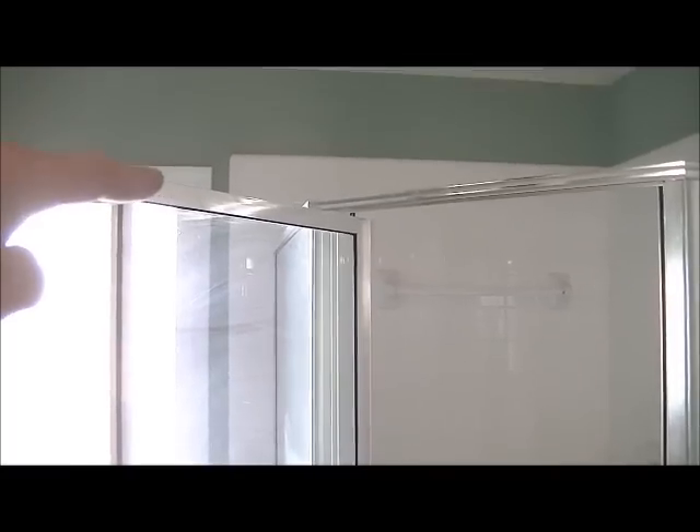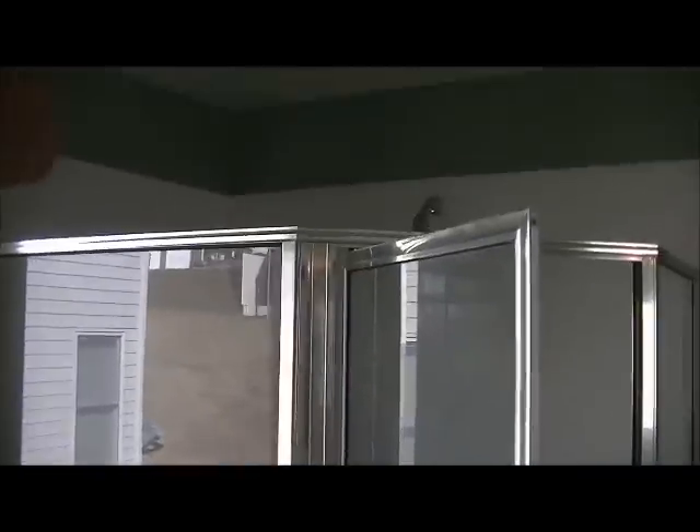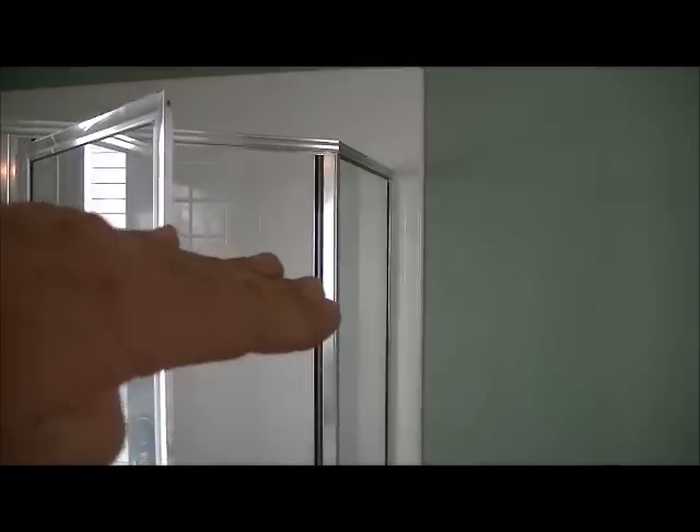This shower would probably be a good part of 12 foot long, which is not really practical, but probably about half to three quarters of this room — I'm going to extend this out. This will become a wall coming out here. This knee wall will go away and I'm going to build a 7-foot wall up to about where the window trim is, all the way up to about where the tub is, and then that wall will drop down to 5 foot and come across to a point which you can enter. There will be an opening of about 24 to 28 inches. It will be a step-in shower — the curb will be right here. You will step in with no door needed because you have 6 feet of room before you ever hit the shower head. So this will be a shower with no door and full tile walls with an opening.